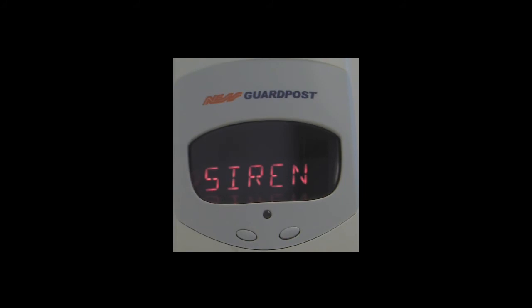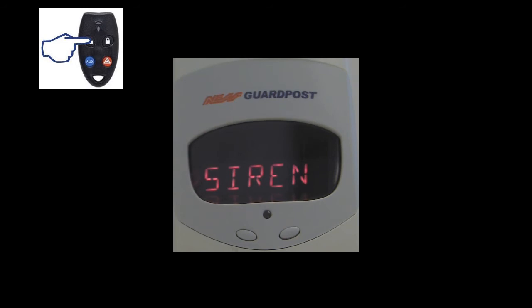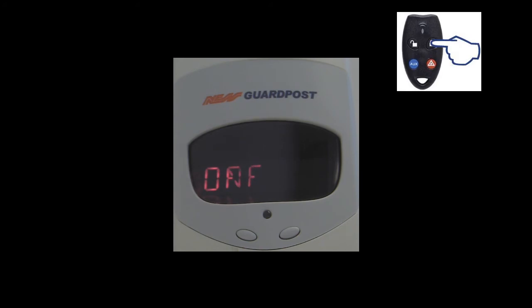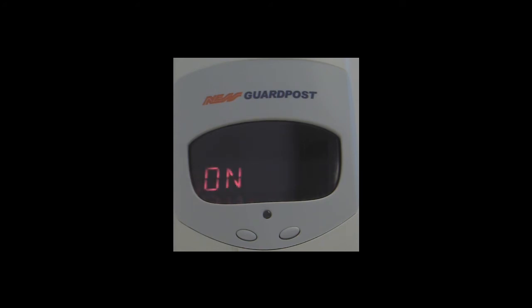Pushing the off button on the radio key again takes us to the next option, which is Chirps, or external siren chirps. If you have an external siren connected to your system, this option allows you, every time you arm and disarm the system, to chirp or pop the outside siren. For arming you will get one chirp, and disarming will provide three chirps. It should be noted that the chirps will only occur when arming and disarming the system and not when putting it in home or home 2 modes. Pressing the on button enters into this option, and subsequent presses toggle between on and off. Once you have the option you wish, press and hold the panic button to lock in and save that option.